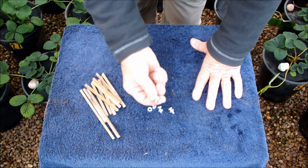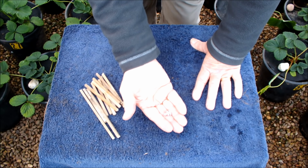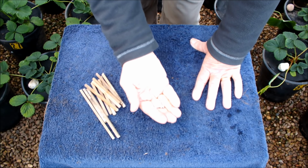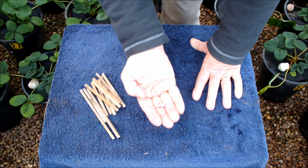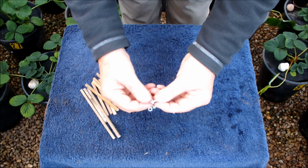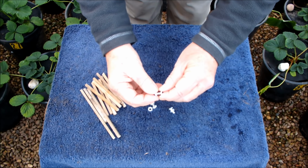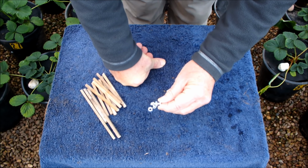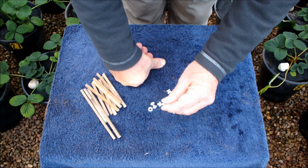So you're going to take the bolt out, take the member out, put the right member in, put the bolt back in and tighten it. But what you find is, because you've nipped this bolt, you've over tightened it, and what happens is you've got an aluminium nut going onto an aluminium thread, and when you over tighten it, the thread picks up, so the nut and the bolt become as one. It fouls up, it won't tighten anymore.